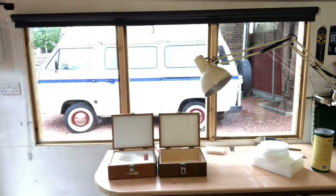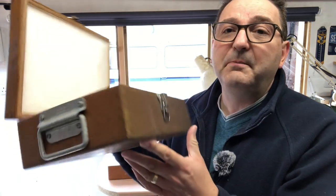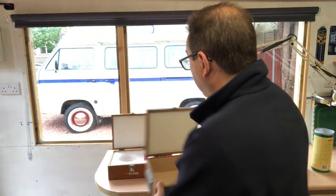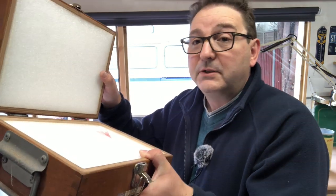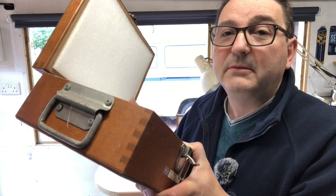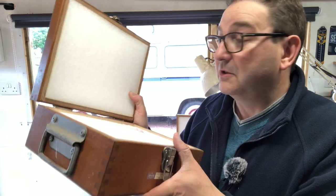Over here we have our fix - these are wooden boxes that you can pick up from any car boot sale. They tend to have things like engineering instruments in them; these have had machine tools, so you can see the foam inserts for a round tool. I've got a few of these knocking around, so my plan is to strip out the insides, take the lids off, and use the two bases without the bottoms to make the cope and drag. I've got an idea how to use the latches so it's all looking neat and smart. Let's start getting the foam out.